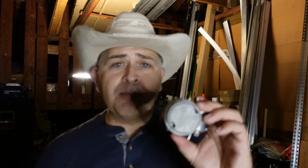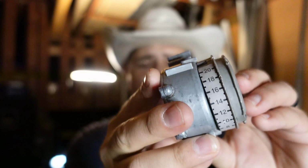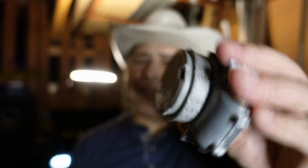That was just something the winding tool from Wayne Dalton didn't really do properly. It had these numbers on it, and each time the number would turn, you would hear clicks, but it wouldn't necessarily mean that it was actually doing a full turn. So this is one of the reasons why I don't recommend this tool, because it's just not as efficient as your standard 5/8 socket and socket wrench.